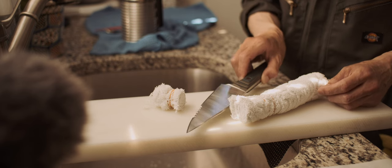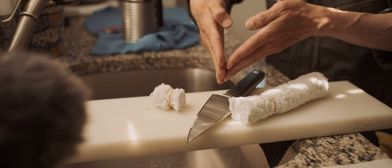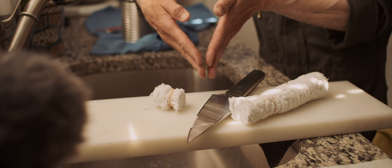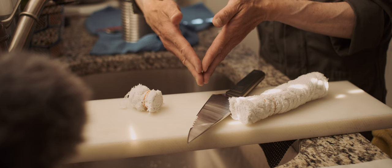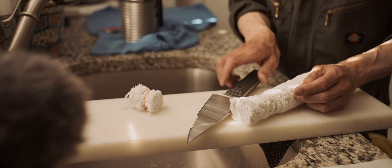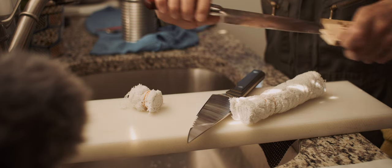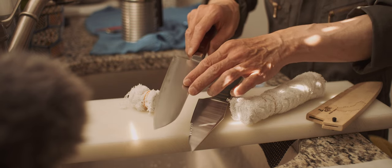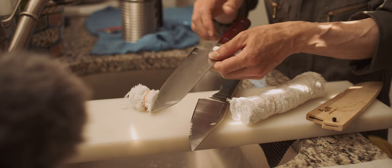The very basic rule when you try to modify the knife from traditional, more conventional double bevel to single bevel, or to be precise, almost single, extreme asymmetrical bevel, number one: don't pick up the knife with laminated construction. You are only going to lose the cutting performance if you modify thin blade stock laminated construction